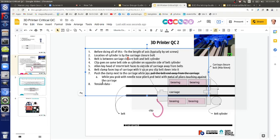It won't move. It'll get above 2 pounds. It'll torque the bearings in your motor and wear things out eventually. Yeah. But the first visible sign, in terms of what we can quantify right now, is that it's going to go way above 2 pounds of friction. So if you had it at 2 pounds, and you can see it move easily, and then you tension the belt and it's very hard to move, measure it. I would say max, don't allow it to go above 3. We said 2 already, but here is where we're actually tensioning things. 2 was a start, so we still have a little way to go. I wouldn't go above 3.